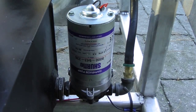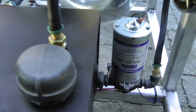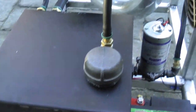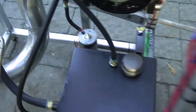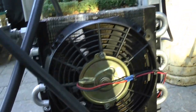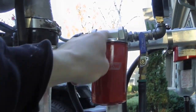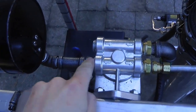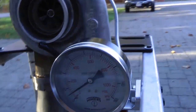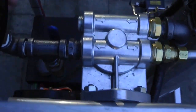The oil system uses a 12-volt SureFlow diaphragm pump that pumps oil from this custom-made, custom-designed oil tank. It sucks it through the pump, up this tube, into the oil cooler. Then it goes from the cooler up here where it branches off into four options — it can either go straight to the gauge. I like to run it at about 60 PSI.